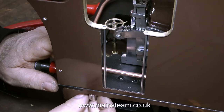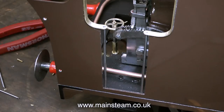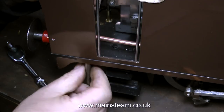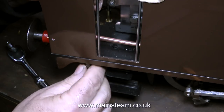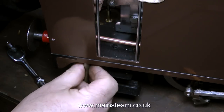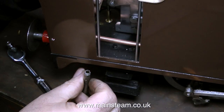Anyway, back to this one — it works differently, so I'm following the same procedure. I'm using a couple of 4BA brass bolts to fasten the brass angle to the running board. First I fitted the nut onto the thread using the small socket full of tissue paper, then used a box spanner to tighten it all the way. I've paused the video to show the modification to the box spanner that I did many years ago — it just allows for a bit more clearance in small spaces.